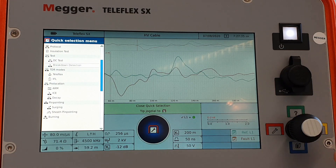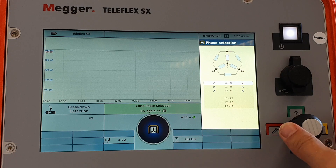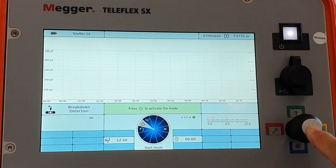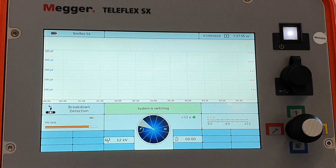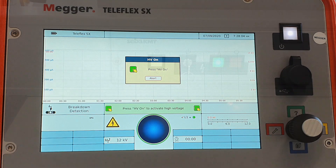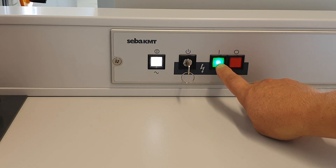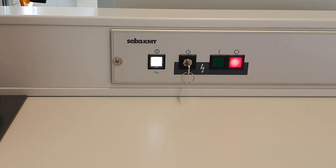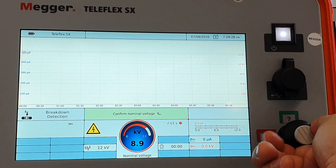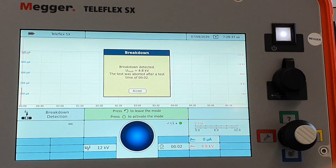I will go into the breakdown detection mode to find out my breakdown voltage. It automatically jumps to phase selection — I accept that and close the window. I give it the maximum voltage I dare to apply. I press Start and hear the automatic switching inside the unit. I confirm by pressing the green HV on button — this is to consciously confirm that I am applying high voltage; it must be a separate hardware button so it cannot be interfered with by software. I can now fine-adjust my voltage, and I see my voltage building up. I got a flashover at 4.8kV.